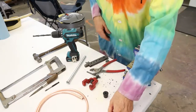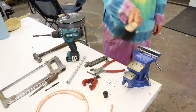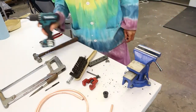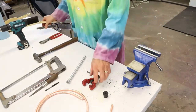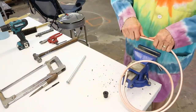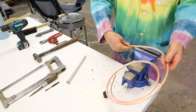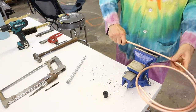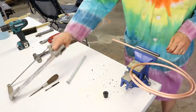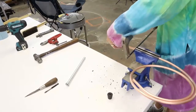Got a hole through it. Now I'm going to cut a piece of copper tubing. Normally I would use a tubing cutter, but I can't find mine so I'm going to use a hacksaw — I'll cut off about six inches of copper tubing. This is pretty soft stuff, so when clamping it in the vise you need to be real gentle because you can crush it pretty easily. It's not going to take a lot of pressure to cut it. There we go.